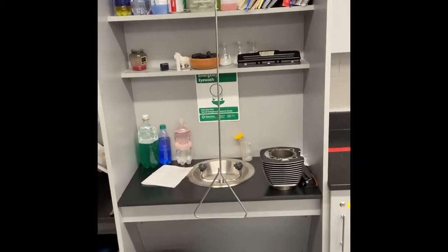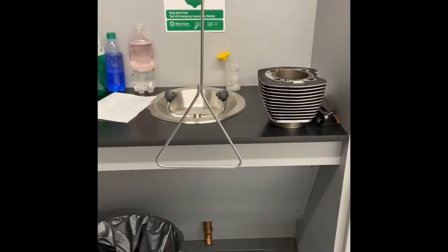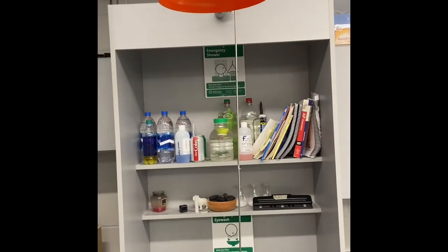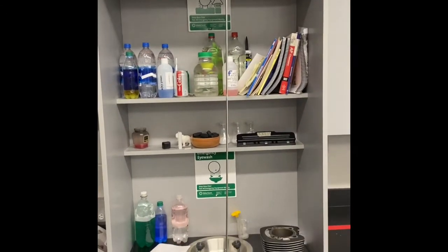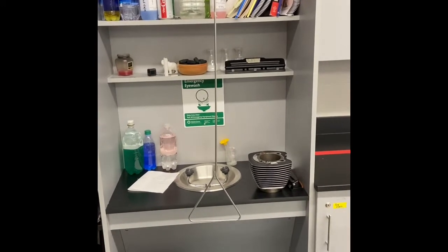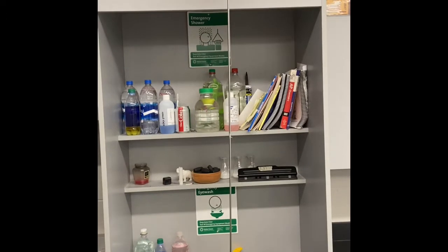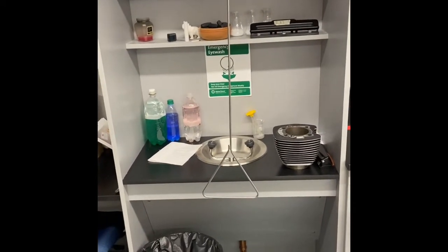This is a safety shower. One of the things you'll see here is that little triangle pull handle right there. You do not, under any circumstances, want to pull this just to see what happens — there is a huge amount of water that will come crashing down on you. On the other hand, if you have an excess of chemicals on you, that's what this is for. It's not to put out fires — it's for if I were to spill a huge amount of acid, base, or some other caustic chemical on me.